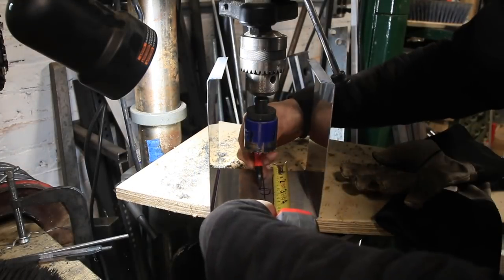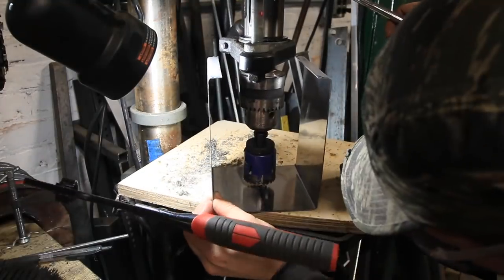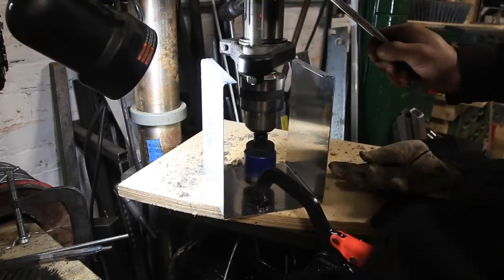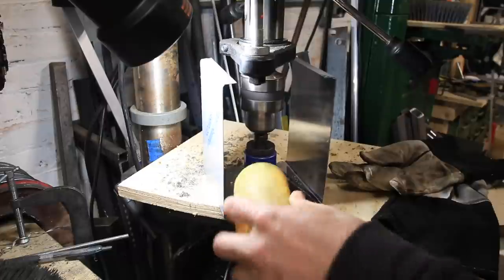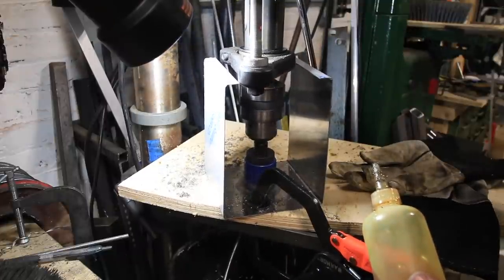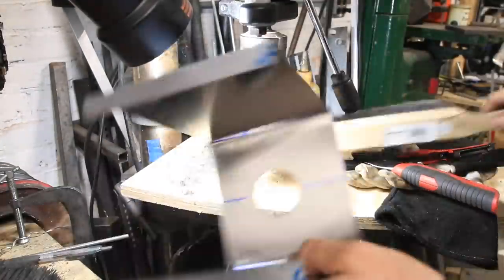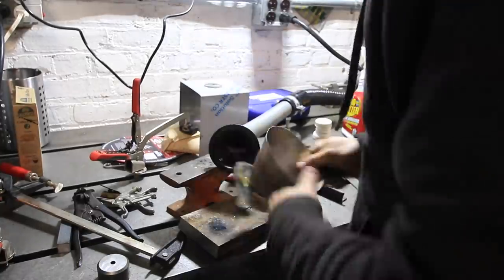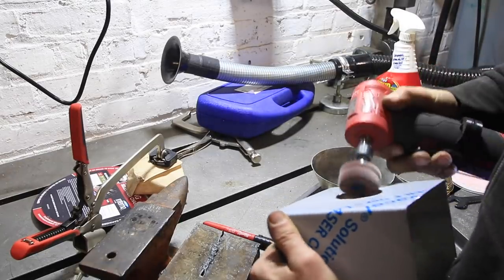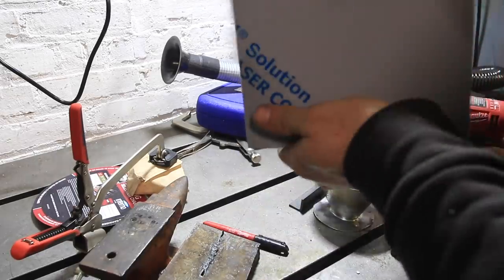Once that was all done I went back over to the drill press, grabbed a hole saw, and drilled in from the bottom making sure I found the center. I wanted to do this after I bent it because I didn't want that hole to cause the metal to bend strangely, and also if I had messed up my alignment when bending I wanted to make sure the hole was going to be dead center no matter what. Again I just have to deburr that hole because anytime you drill, the hole saw usually leaves a pretty sharp point. The whole time I was doing that I was allowing the dripper to cool, and I let the fume extractor stay on it, which just helps air rush over it and cool it much quicker.